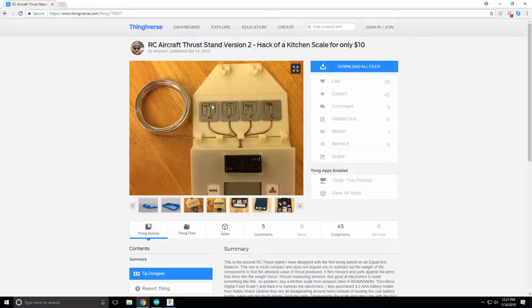And you could determine that force by 3D modeling this design, and then looking at what force it takes to push this bridge down. So you say, okay, 50 grams or whatever, pushing at the edge will cause this piece to flex 1 millimeter, let's say, even though that's very exaggerated. That's a very high flex. Let's say it's 0.1 millimeter. And 0.1 millimeter will go to this resistive number, right? So let's say 5 ohms or whatever. And you say, okay, well, 50 grams, or whatever I said at the beginning, I already forgot what I said. 50 grams to flex 0.1 millimeter equals 5 ohms. So 5 ohms is equal to 50 grams. Pretty much that's how that works.